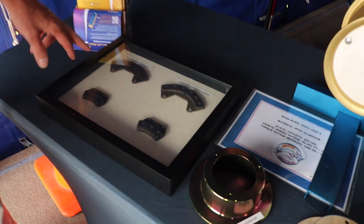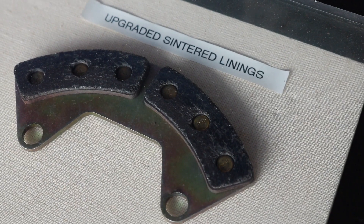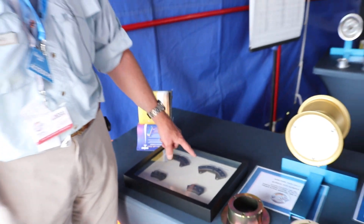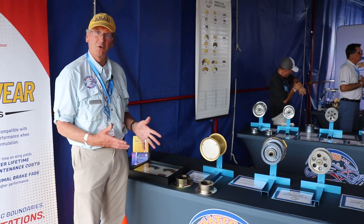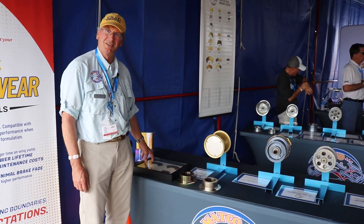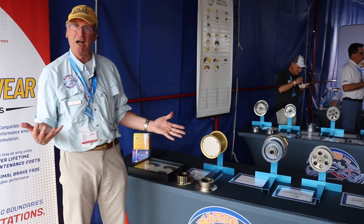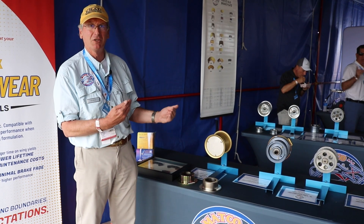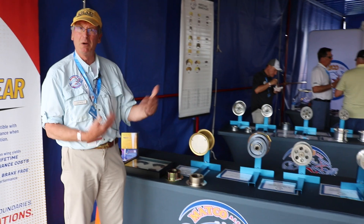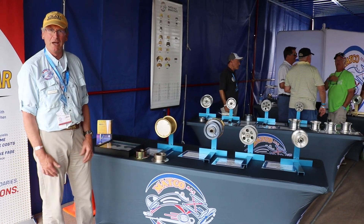The standard lining out there in the industry is a semi-metallic lining. The new lining is a sintered lining. Both of these linings have gone through about 45 rejected takeoff stops, and you can see the wear debris built up on this disc. One side benefit is that the sintered lining runs extremely clean. More importantly, the sintered lining holds its friction performance well up past the design region set for the semi-metallic. In the same brake configuration, you're going to have a higher safety margin for that high-energy stop — the RTO, the rejected takeoff. We don't anticipate changing the energy rating at this time, but there'll be a significant safety margin in real life for the pilot.